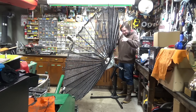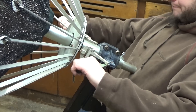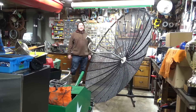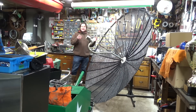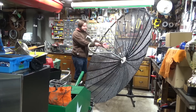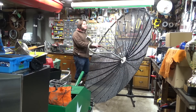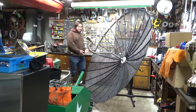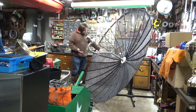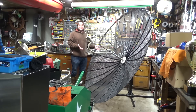It's really hard to even get it open enough to get these little lever clips into place. Alright, I think that's how this is supposed to look. I might still need to adjust a few things like the LNB positioning — it was a little loose, I tightened it up, but I'm not sure exactly how far away from the dish it's supposed to be, so we'll have to look at the manual. But yeah, this looks like it's in pretty good shape. All the little fiberglass arms are good, nothing's broken, I don't see any rips in the net. So knock on wood, this thing should be ready to go out and pick up some satellite signals.